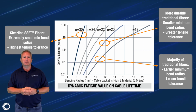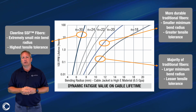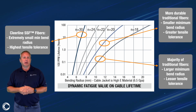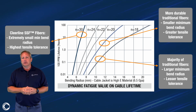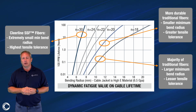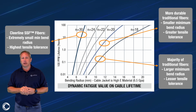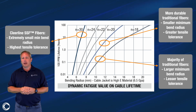Additionally, SSF can endure a minimum bend radius of 2.2 mm at the 125 micron cladding layer. Compare that to Cat6, which shouldn't be bent below 4 times its diameter, or approximately 25 mm, 1 inch radius. One last benefit, as proven by the tests conducted, is the enhanced installation pull force tolerance of SSF fibre. With a maximum installation pull force tolerance of 225 pounds when utilising the aramid strengthening yarns, that's 9 times the tolerance of category 6 at 25 pounds.